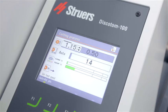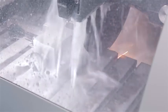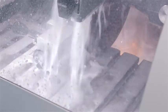If the feed speed is too high, the workpiece may be burnt. If the feed speed is too low, the process will take a long time, possibly too long. I would recommend that you always start with a low feed speed in order to gain some experience with how your specimen is behaving.